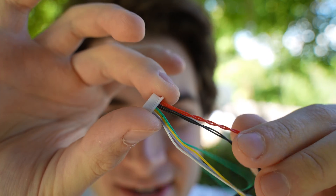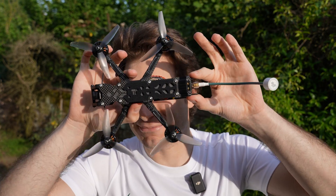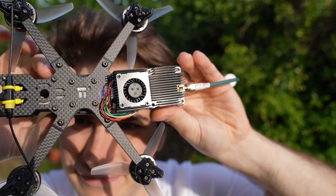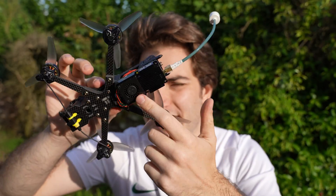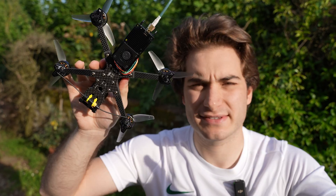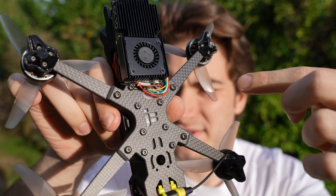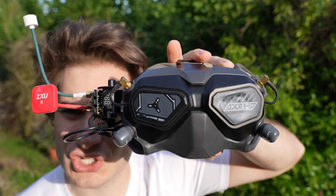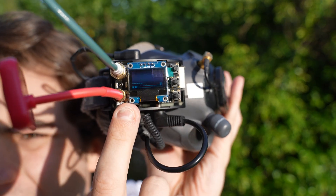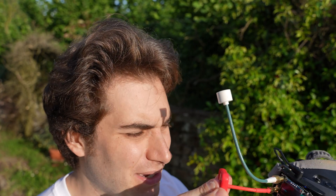Before I mount it on a drone, just look at the cable — this thing draws so much current that you need two wires for the positive and two wires for ground. And just look at this contraption: it doesn't look bad from the top, but from the bottom it looks like it has a GPU strapped to it. It's on a four-inch drone, so that's why it looks so big. The install process is pretty easy — this VTX can take up to 6S power, so just connect it to the XT60 plug. It outputs 5V for the analog camera. I'm using DJI Goggles V2 with the DJI adapter, and I've installed the AKK receiver, which seems pretty well made — fast and intuitive.